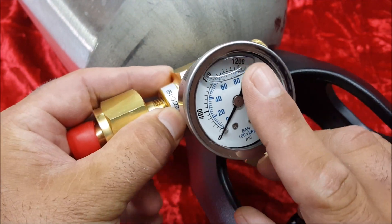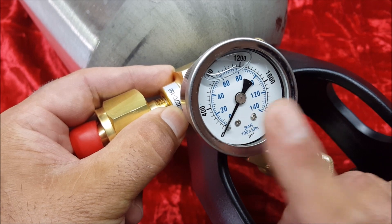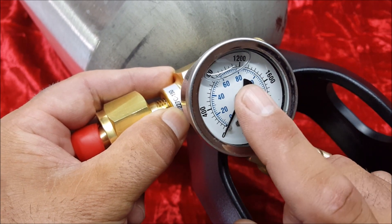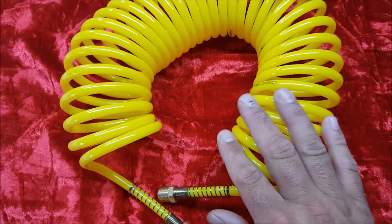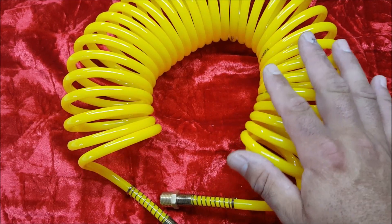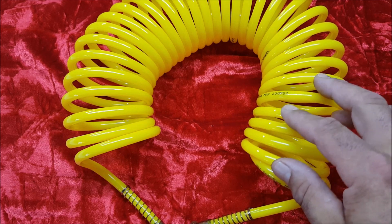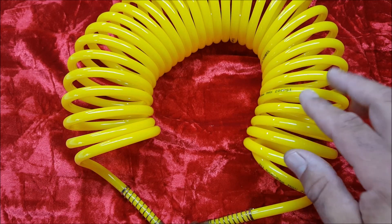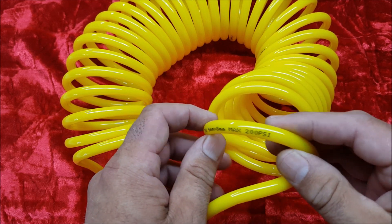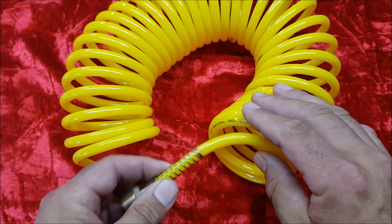This gauge is essentially useless for determining how full the tank is. It will not tell you how much CO2 is in the tank — it'll only tell you if the tank still has liquid in it or not. Therefore this gauge really isn't necessary at all. The next thing we need is a hose. I prefer a recoil hose for this application due to its simplicity and space-saving nature. Be mindful that most quarter-inch recoil hoses are only rated for 120 PSI — you want more than that. I recommend a hose rated for 200 PSI. I bought this 200 PSI recoil hose on Amazon for $10, and it gets pretty good reviews.